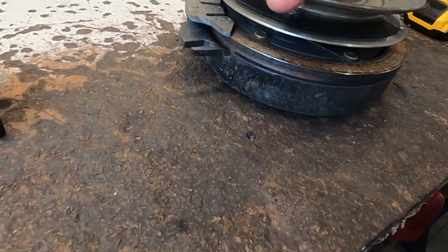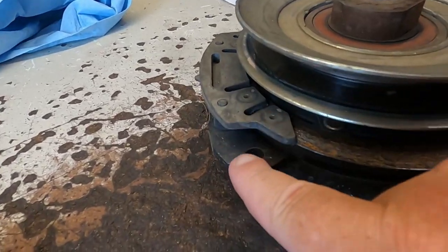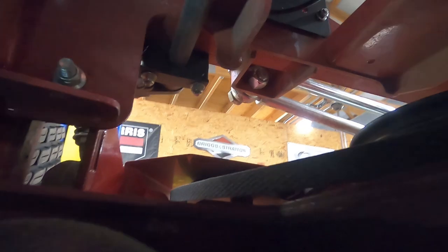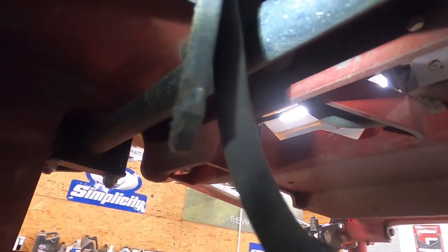So that's why we're replacing it. Here is the major flaw of these mowers — I don't know what Ferris is thinking with this, but this piece right here is what goes. If you look up here, here is the bar that the clutch engages to, or keeps it from spinning around. And if you look at this bar, it has worn almost halfway through that bar. I don't know if it was because it was a bad clutch or if it's really a flaw, but yeah, that's absolutely crazy.